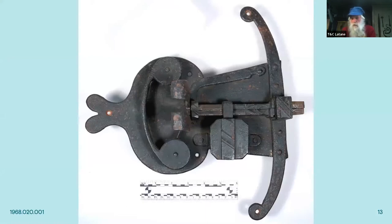This is the first slide showing a pair of bolts with angled ends. The advantage is that when closing the door from the inside, you don't have to draw the bolts back — they strike against the angled keeper on the door jamb, are forced back, and snap into the opening to lock the door. This kind of lock was popular because you didn't need a separate latch. You'd need your key to get in from outside. The ward box on this one has two small feet riveted to the back plate, with file work on the T-pin and countersunk, flush rivets.